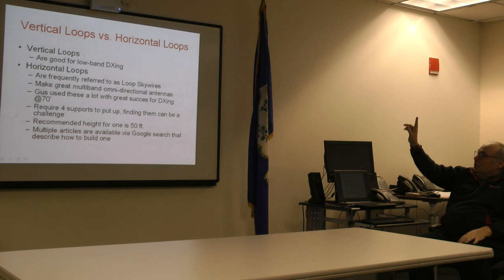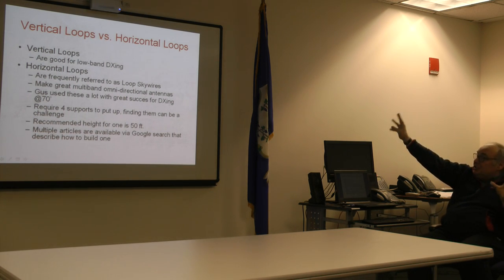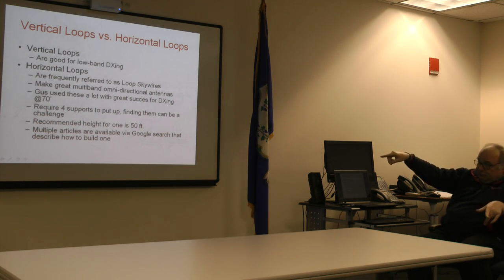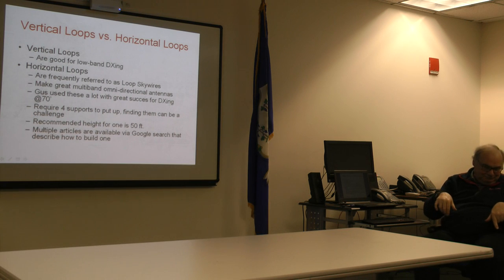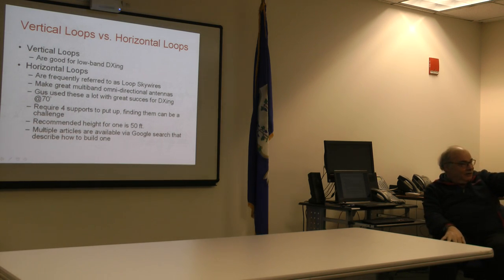All right, so we talked about the vertical loops: good DX solution, low angle radiation, vertical polarization, relatively low noise compared to a conventional vertical. Horizontal loops. The only example of a club member that I know of was Gus, all right?